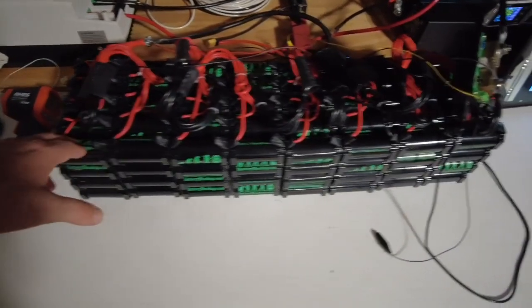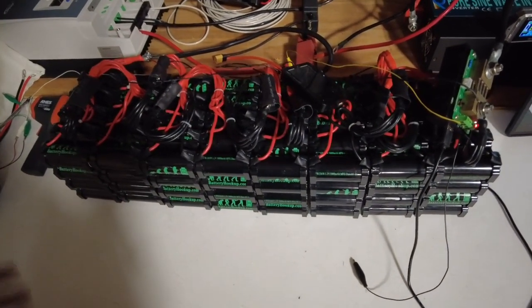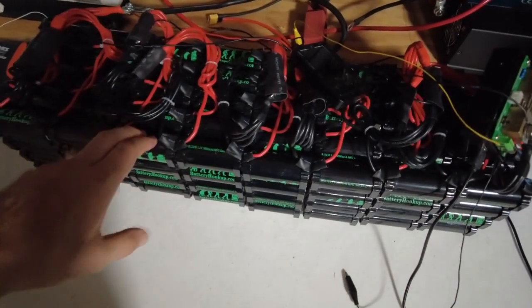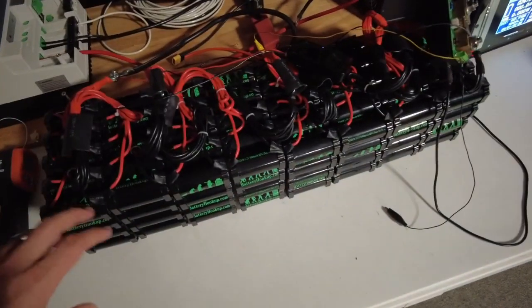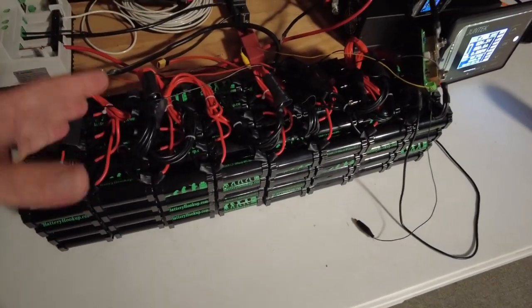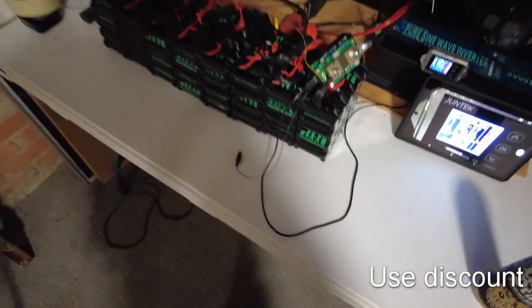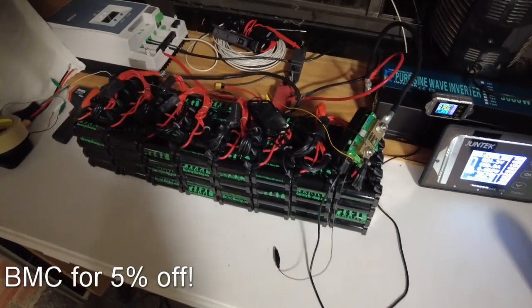These cells are great for $50 a piece. This whole pack is $400 and it's 100 amp hours at 24 volts — it pulled 107.51 amp hours and 2,624 watt hours. You just don't get that very often. Buying an already-built battery off Amazon or from a well-known brand, you're going to pay three to four times what this cost for this kind of capacity. Battery Hookup is here in the US — it's not going to take forever to ship, and if you have a problem, it gets resolved. See you guys on the next video.